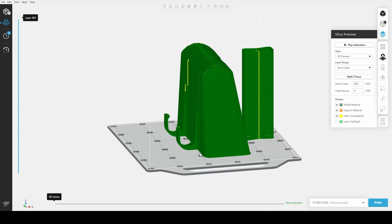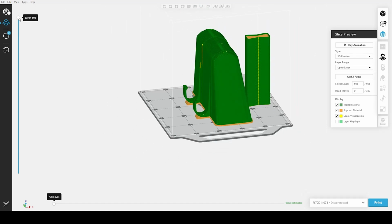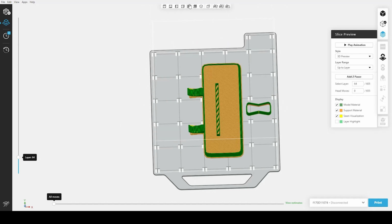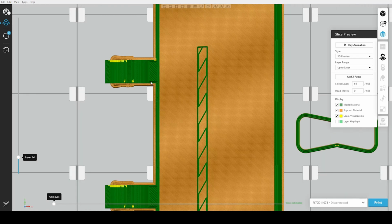and then we have the raft on the bottom. And I'm going to just slice this, and as you can see, I have the support structure here on the top, and I'm using model material for support. And going down, actually you can see the infill. Let's see. This is the infill around 75%, and I will show you later on what I've been using on the inside.